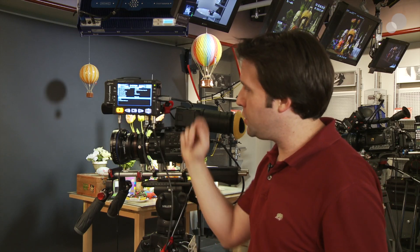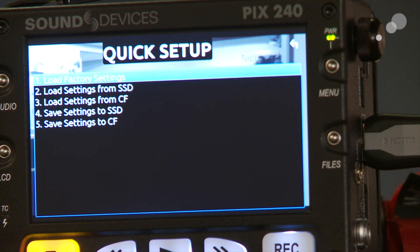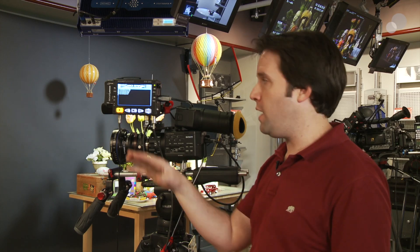There's another cool option I like, which is called Record Button File Split. We talked before about splitting files based on length of time. Here you can actually split a file on demand — say you're recording a long take and you want to keep rolling but split the clip for security. Hit the record button again while recording and it splits the clip. And finally there's Quick Setup, which allows me to save settings from the unit onto SSD or CF card, then load them into another PIX240. So if I have multiple PIX240s on set, I'm all set that way.